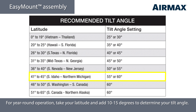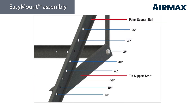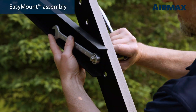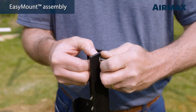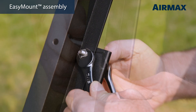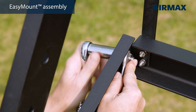This will give you the optimum tilt angle in winter months when daylight hours are reduced by 50 percent. Solar panels will receive ample sunlight during the other seasons even when set for winter operation. Next, refer to the tilt angle settings in your product manual and attach your tilt support strut to the appropriate hole in the panel support rail. The angle settings are based off the difference from the horizontal plane. Remove the tilt support hardware from the temporary location on the support rail, and secure each support strut in place with the tilt support hardware, tightening completely using two 3/4 inch wrenches. Continue by installing a panel support rail extension, removing two bolts, lock washers, and nuts from the end of the rail extension connector, and tightening using one 7/16 inch wrench and one 7/16 inch socket wrench. Repeat for the opposite side, then tighten all four pivot bracket bolts using a 3/4 inch socket wrench.